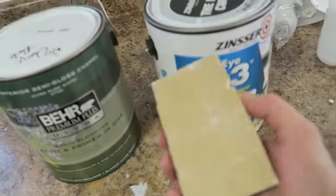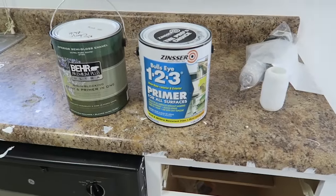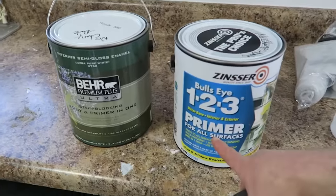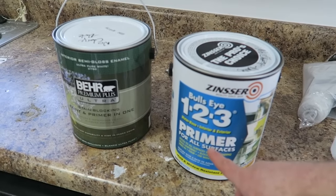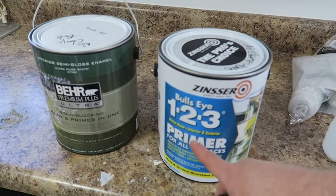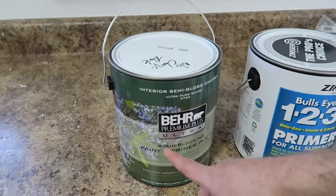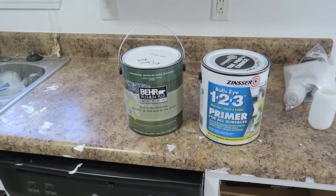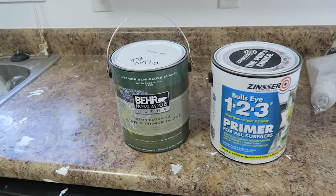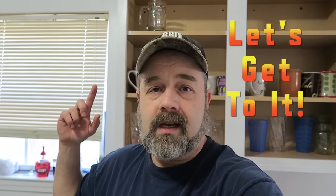So here's what we're going to do now. We're going to sand — I don't need to take it all off, I just need to knock it down and make it smooth again. Then we're going to put this primer on there. According to Dale, this will lock everything on so you won't have any peeling. Then this white color goes on — it's a stain blocker. They also have another color I'm going to add, but I want to do it before I talk about it because I think it's going to be cool. Time to start sanding — let's get to it.